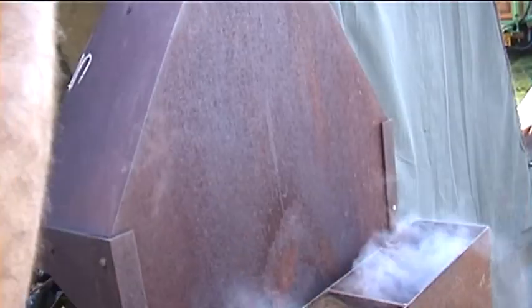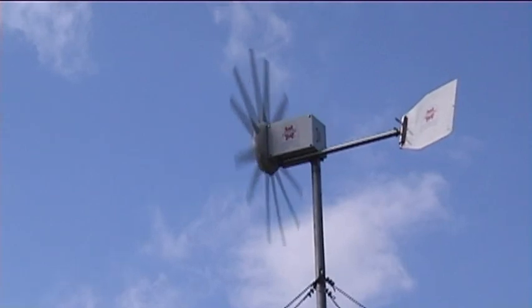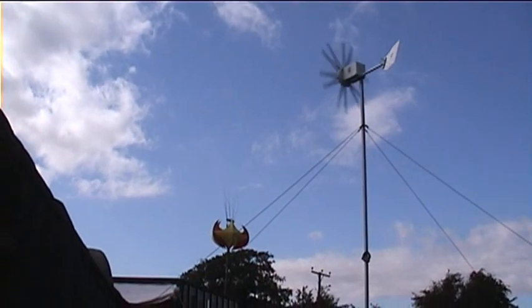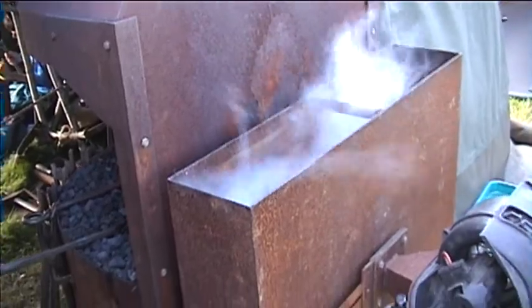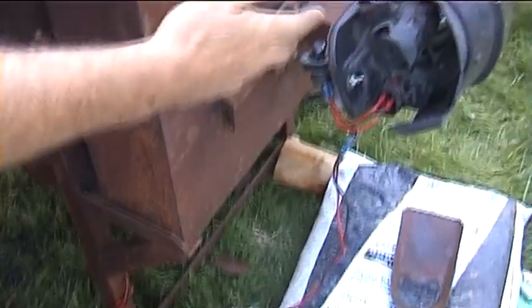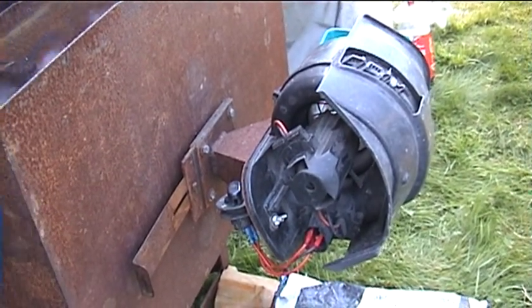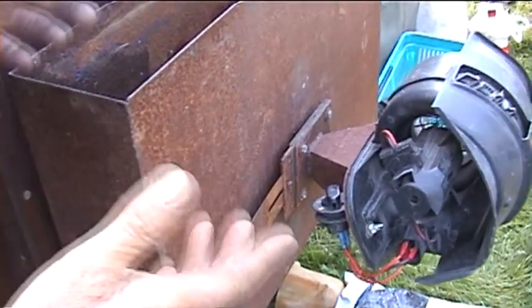What we've basically got up in the air there is a turbine that's kicking in — at the moment it's about 5 knots, so it starts charging at about 5 knots. It's sending the energy to a regulator which is managing the system into a battery bank, then the energy is coming from the batteries into a Renault Clio fan — the fan that goes behind the dashboard of the car that blows air in to keep it warm or cool, or for the demisters.